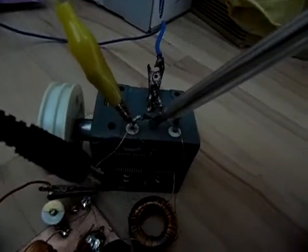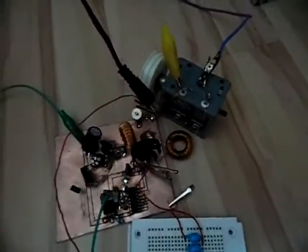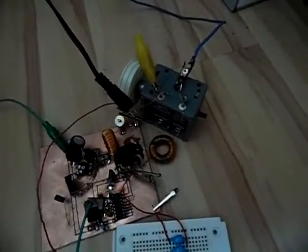What I want to show you with this video is that you really will get issues with the voltage. You need capacitors like this air capacitor - which are quite high quality and can withstand the voltage. But if you use something like the red tuning capacitor you see here, it would pretty much fail quite soon.